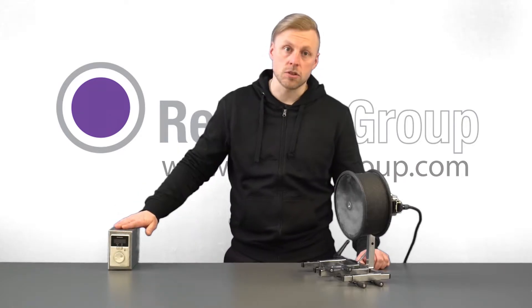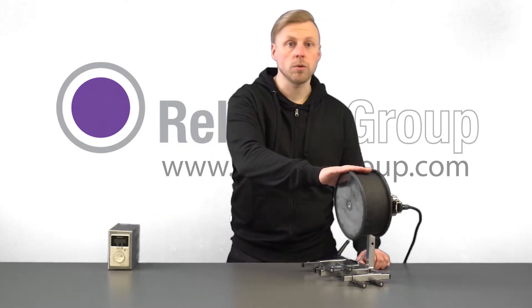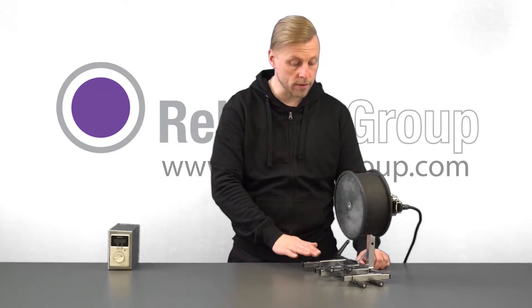The pullback unit consists of three different pieces. The first one is the steering unit, the second one is the rotating motor, and the third one is a construction that allows you to fix the rotating motor to any kind of pipe.